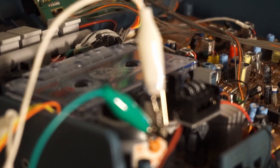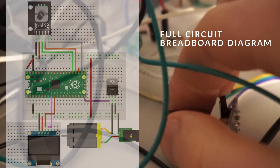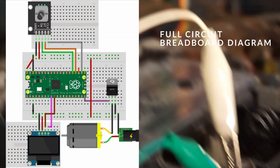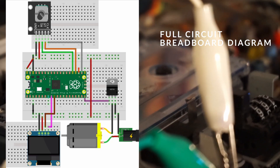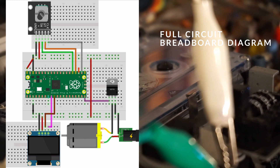Adding pitch control to a tape machine is a really common mod. However, the traditional potentiometer method is a bit limited in that it does not allow for accurate control of the playback speed, nor does it provide any autonomous way of modulating speeds over time. Although it is possible to add control voltage to this method, this can get quite complicated and still not be particularly accurate.